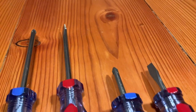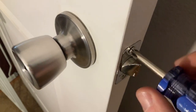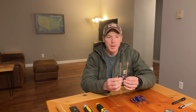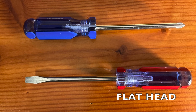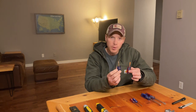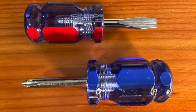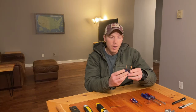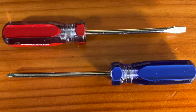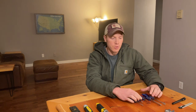The basic foundation of any toolkit is going to be your screwdriver. You use these for tightening things, building things, fixing adjustments — anything held together with screws. You have two basic types: a Phillips head and a flat head screwdriver. I recommend a number one and a number two Phillips; that should get you through most size screws you'll need. These short stubbies are really handy for small areas, working in vehicles or in the back of sinks tightening collar screws. You can also get smaller size screwdrivers for more delicate things. A basic set from the hardware store will get you started.